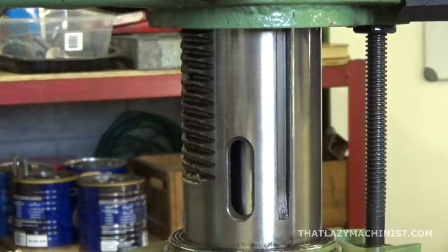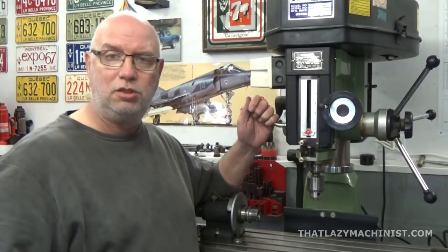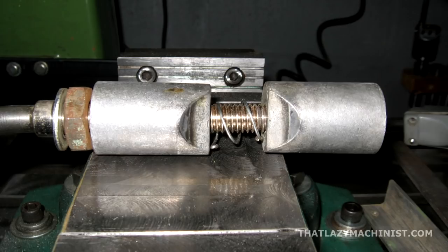The next thing I want to look at is this spindle or quill lock. These double wedge locks are often grabby and gummy — they're not pleasant to work with, and the handle rarely sits in a comfortable position when it's locked. What I did to solve the problem is quite simple. I did two things: first, I added a spring between the two halves of the spindle lock, and I added some shims to back the handle up.